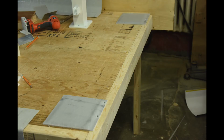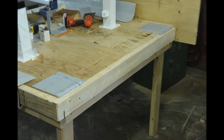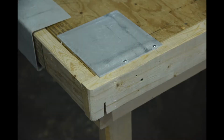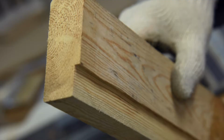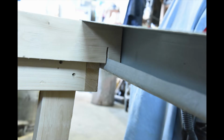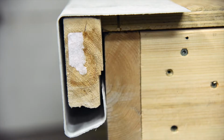After the plywood decking material is fastened and the flashing mounting wood is fastened to the side of the deck, the flashing mounts are 2x4s with slots cut into the side of the wood. This can be done very easily on a table saw. You will need to cut a slot in the ends to allow the flashing to be slid into place.